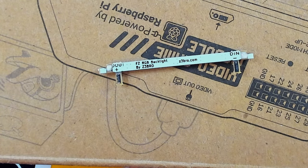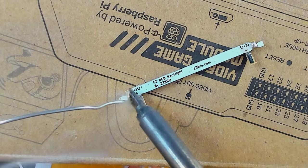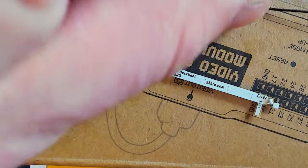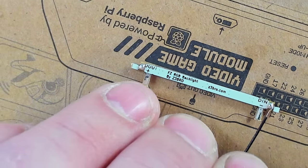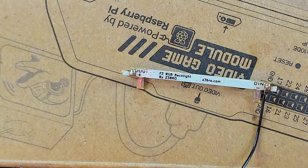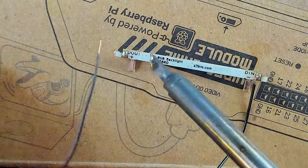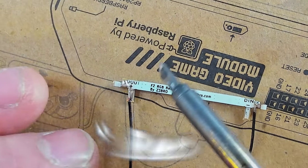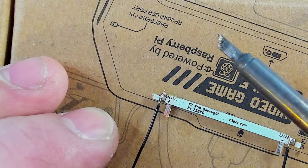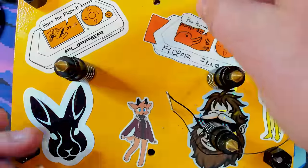I have this wire prepared — a shorter one going into the D-in data-in. Just ever so carefully get this wire stuck to that pad. Got it. Then a longer wire going to the D-out. Same thing — tin a little bit and just ever so carefully get the wire attached. The wire is a little long, I'll clip it. Now we have our backlight wired up so far.